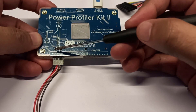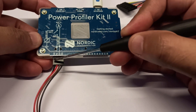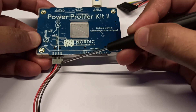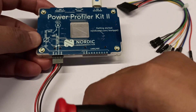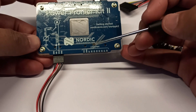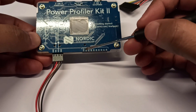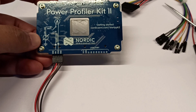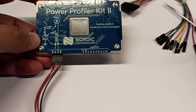The two pins are for giving power output. In ampere mode, you need to provide external power from these two pins. And with the help of V-out and ground — these two pins — it will power your device under test. In Power Profiler Kit 2, they have also provided eight digital input pins, which can be used as a low speed logic analyzer.